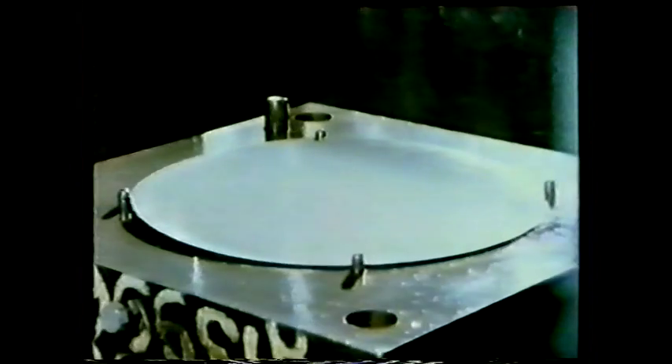The metal is formed into shape by a series of pressings. The body of the kettle is shaped by deep drawing, which needs a large press. In the design of the shape, care has to be taken to avoid cracking round the base.